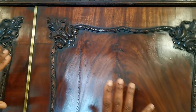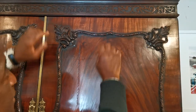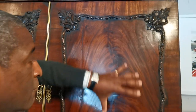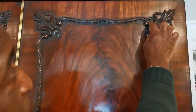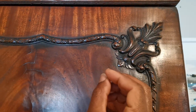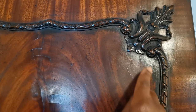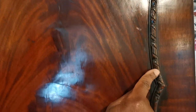The two doors are veneered — where the cornice is solid, these are veneered. They've cross-grained the veneer and then in the centre they've put this lovely flamed piece of mahogany. Left and right in the corners, and top and bottom, you have this lovely hand-carved section with S scrolls and C scrolls — the detailing is absolutely amazing. And then it's held together by what we call an escutcheon-shaped moulding, all in what we call ribbon moulding, like garlands and ribbons, beautifully carved.